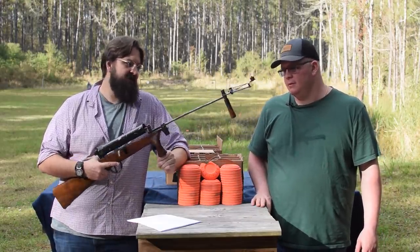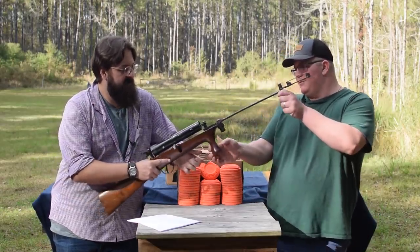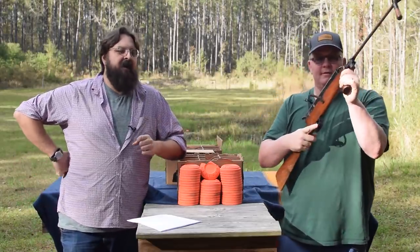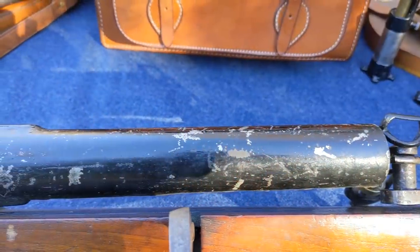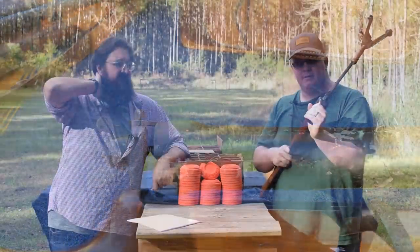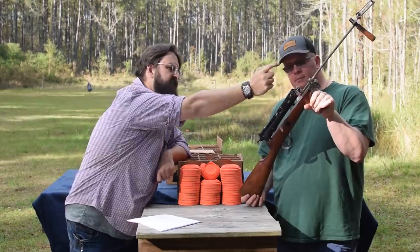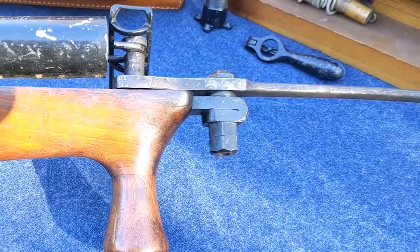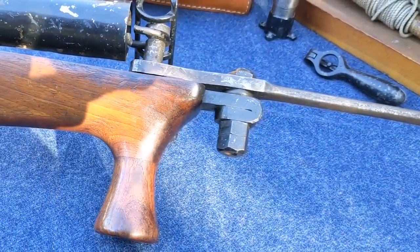The Blanton is essentially a trap rifle. At first glance you're gonna think this is the DuPont all over again because of the overhead latch on the right side. However, there are some key differences. The way this is constructed, it's like a folded metal spring that comes up and then folds up as a hinge — look at this, it's folded over. The principle is the same but the execution is wildly different.